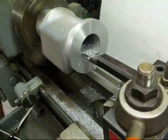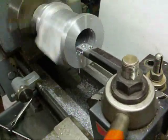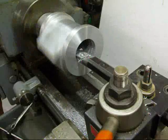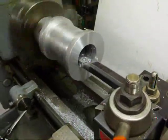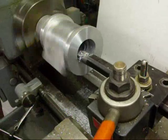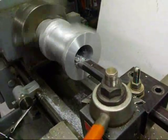I'm still running into a little bit of core sand, which is very abrasive, and I think it's wearing the tool already. I don't like to get any of that sand on my lathe. More than likely I'll have to change the insert or rotate it as I get to my final cuts. I'm only at about two and one-eighth of an inch now and I've got to go clear to two and a half, so that's an awful lot of boring and a lot of metal to remove. I probably should have had a larger core.